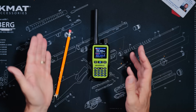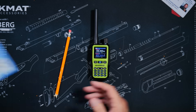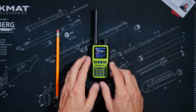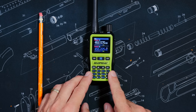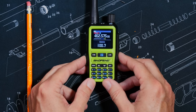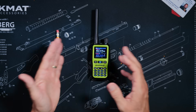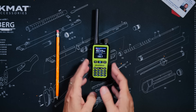There is also an entire other demographic of people these radios would be perfect for. This is a ham radio, also known as an amateur radio — that's why it says amateur radio right on the user manual. Even though it is not locked and can transmit on GMRS frequencies, this is not a GMRS radio. This radio can also transmit on several business frequencies, which is why it has earned the status of unlocked. The radio can also receive commercial FM radio and NOAA weather channels and more.